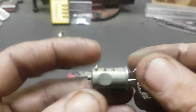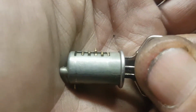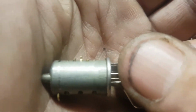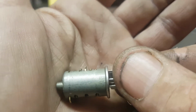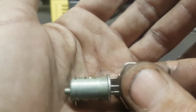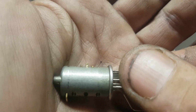But yeah, you haven't got a key, but get that key blank, push it in, and you'll see what height you need to go, how deep you need to go in the cuts. 1 and 5 are basically blade height, so no need to touch them. So it's just 2, 3 and 4. Usually what I find anyway, number 1 is actually a blade cut, so it's a 0 cut, but it's number 1. So it'll be 1, 2, 3, 4, 2, 1.